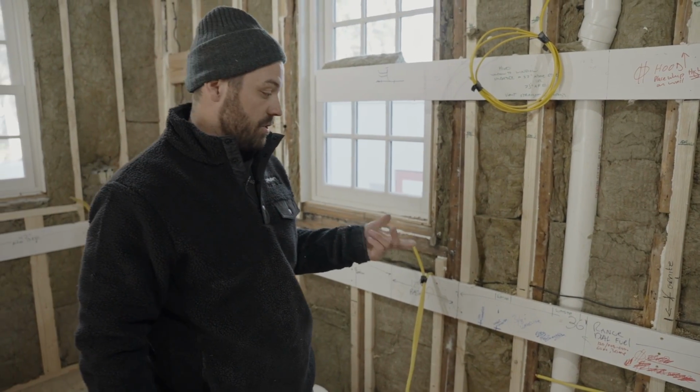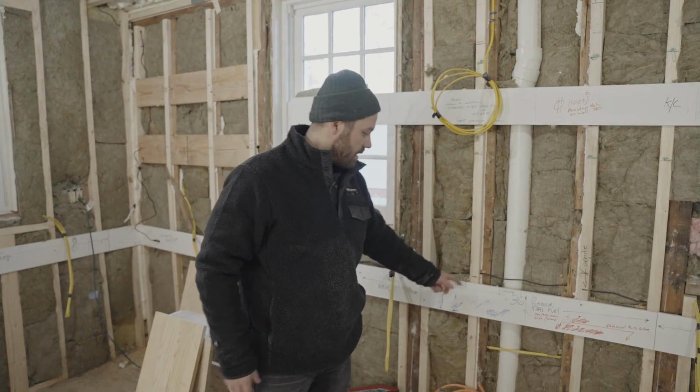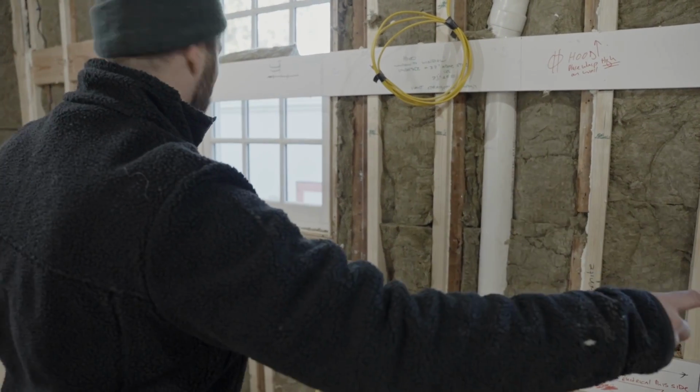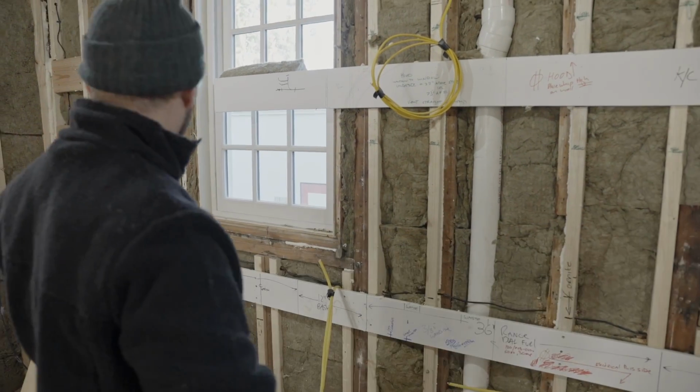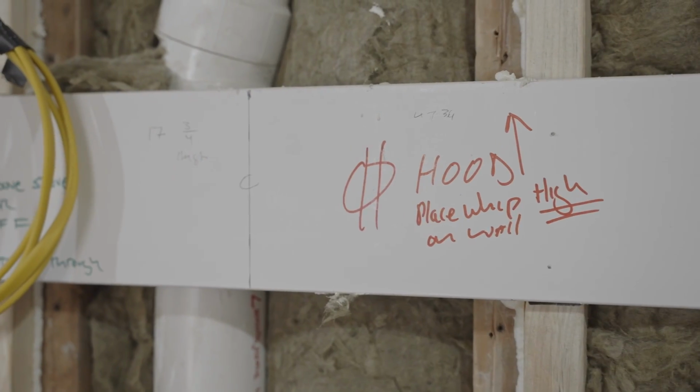One of the things that allows you to do is, when you're taking measurements, because you're taking them all the time to check in with the kitchen designer, this is the same thickness as sheetrock. So if I measure between these two walls and I stick my tape on the face of that and the face of that, I don't have to do any math in my head. I just know what the right answer is for the finished wall surface.